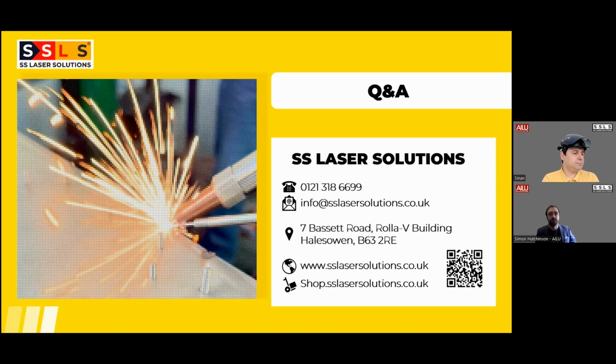So the other question was about Argo Shield. As I said, we use pure argon. So it has to be pure argon. When you say Argo Shield, that can be a brand or naming from a different brand. So personally, I don't know it, but it has to be pure argon. For example, BOC says it's pure argon, it's on the bottle. So there is no other gas but argon inside that bottle. So we are sure that there is not going to be any chemical reaction.